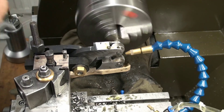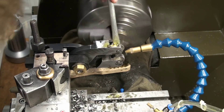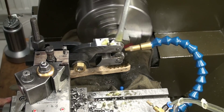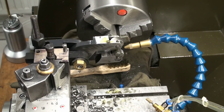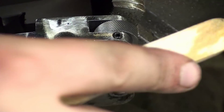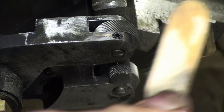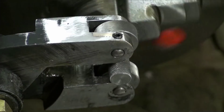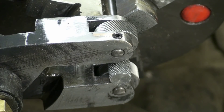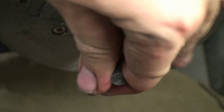Add some pressure and come back. Now we stop the lathe and take a look — I brought the camera in a bit closer. You should be able to see the knurling. I used a brass brush to clean it a bit, and it seems we have a pretty good knurl. As with every tool, there is a bit of a learning curve to it. Let's release the tension screw on the knurling tool and now you can see the actual knurling.